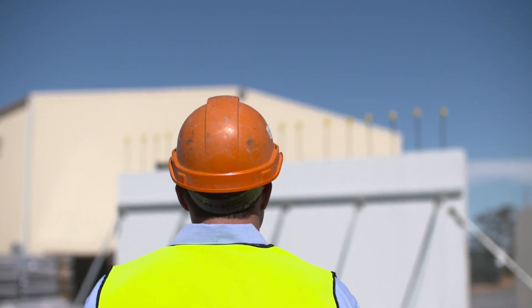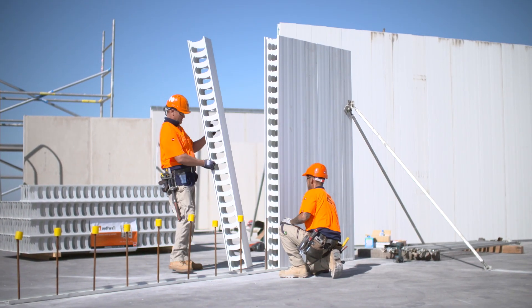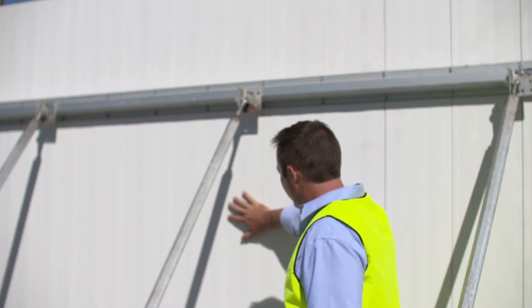Now that both walls have been finished, let's take a closer look. With ReadyWall, the construction time was very fast — it only took 1 hour and 16 minutes, and that includes core filling of the wall. The panels are lightweight and simply snap together, making them easy to handle. No craneage was required. Placement of reinforcement is simple and quick. There is significantly less waste and mess compared to block work. ReadyWall is AS3600 compliant with water, heat and smoke certification, and the end result is a clean, even finish.